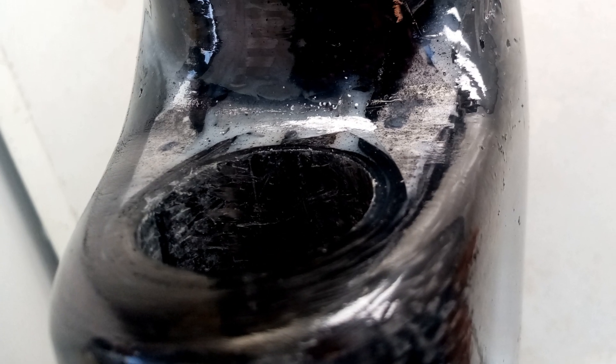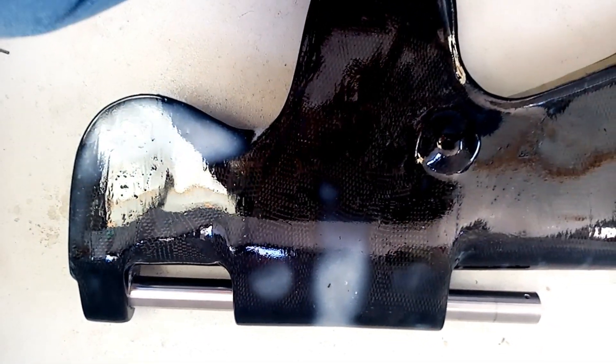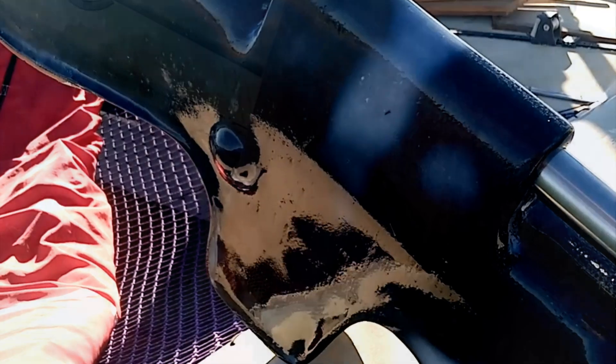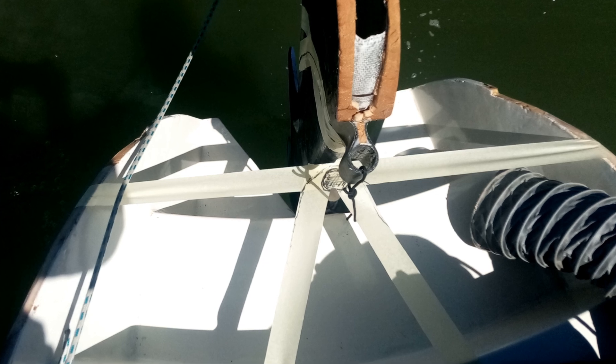The next day I row excitedly back to the boat because I know the epoxy will shine. It's almost a pity that I later will have to put paint over this, because I'm using an ordinary epoxy. That epoxy cannot handle the hot temperatures that this black rudder will get. This is normal carbon fiber UD laid in the directions to take the strain, and that doesn't give that perfect carbon fiber pattern you see in some finishing products. It's actually a pity we didn't bother to take the dust off before painting it — we only needed it to hang behind the boat and line out how the top rudder hinge is going to be made.